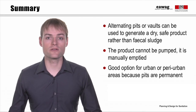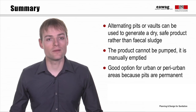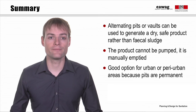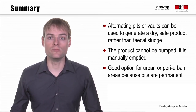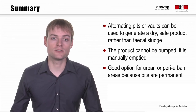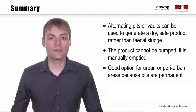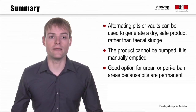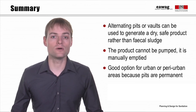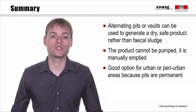In this module, we looked at four technologies which all have in common that they use storage and naturally occurring dewatering and degradation processes to produce a material that is safer and easier to handle than faecal sludge. The products from these technologies can even be used as soil conditioners. Because the material is solid, mechanical emptying by pump is not possible — it needs to be dug out manually. This may be seen as a disadvantage, but also as an advantage in areas where mechanical emptying is expensive or impossible due to difficult access. All double pit technologies shown are permanent and can be constantly used if well maintained, making them particularly suited to peri-urban or urban areas where it is not possible to dig a new pit when the old one is full. However, the potential risk to groundwater sources due to leaching limits the applicability of these technologies in urban areas.